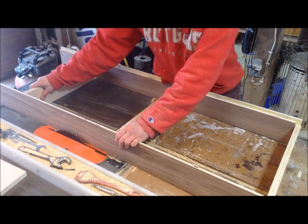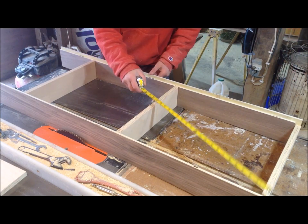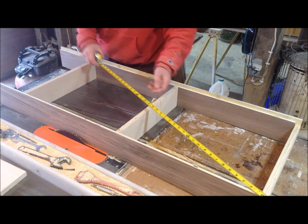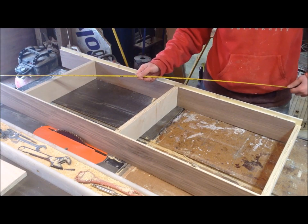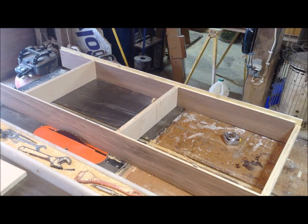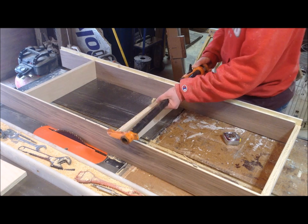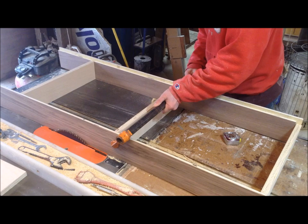She wanted it exposed and with a lot of extra storage. Those two longer pieces are just scraps of ply I had - they're actually walnut veneer ply, four and a half inches wide by a little over three feet long. I cut a couple dados into them so I have three stationary shelves and then the top which will hold the whole piece together.